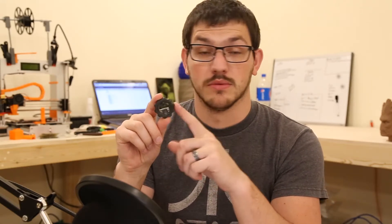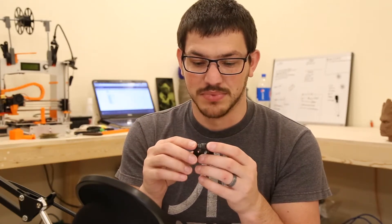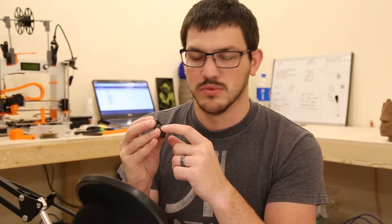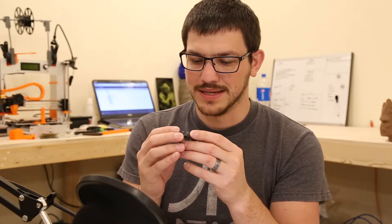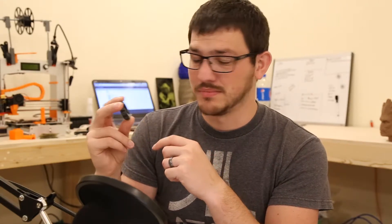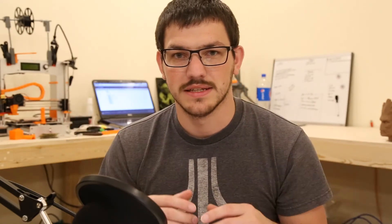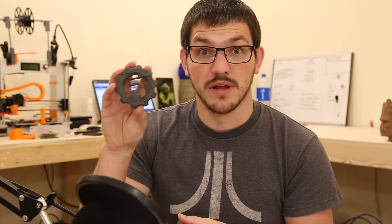Next up we have Dura from Algix 3D. I had a really hard time getting this to adhere to the glass plate, so I printed a 100% model of my coin with five brims. The bottom has to be sanded down. Then mail came in — I got some BuildTak and slapped it on there, and we were able to print a full 200% model. This came out good.